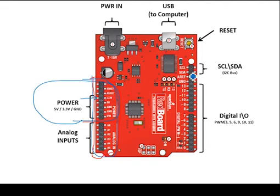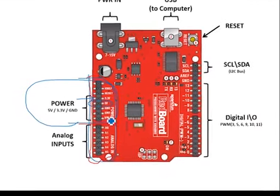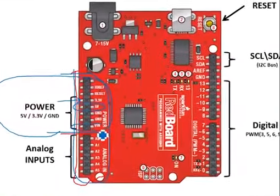But generally, all the other pins, like the digital pins, we are aware that for most of them the output is always 5 volts. So this is maybe the general one. Apart from this particular pin that produces 3.3 volts, the rest are basically 5 volts. All of them are able to bring out 5 volts. Then, of course, we have another reset here. Then I wanted to talk about this pin here.